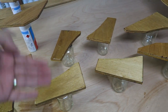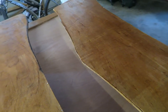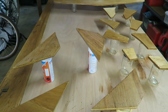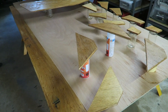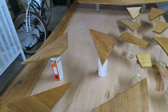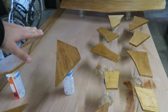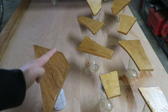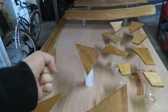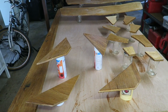These have already been resin coated on one side and all the edges — now it's just the opposite side drying off. This is polyester resin with methyl ethyl ketone peroxide as the hardener and catalyst — a pretty standard dose, all painted on. The plywood is actually soaking it in, and I want to get a coat on there first because I've read that if you don't pre-coat, when you go to glass with fiberglass cloth or chop strand the plywood will suck the resin out and leave the cloth quite dry. Pre-coating in advance means it'll almost reject the resin rather than drawing it all in.